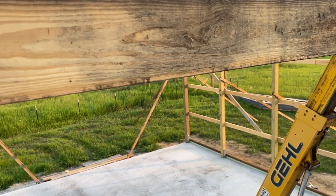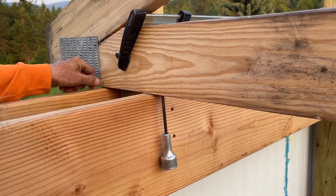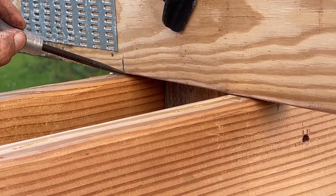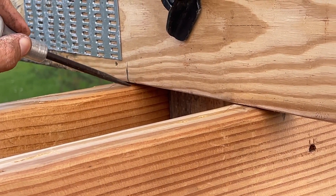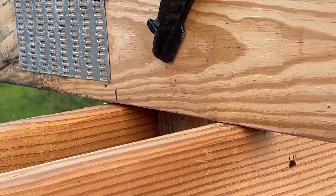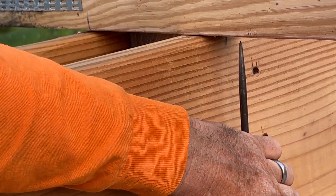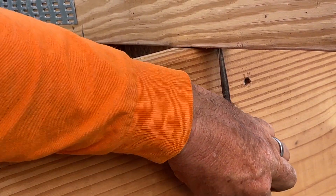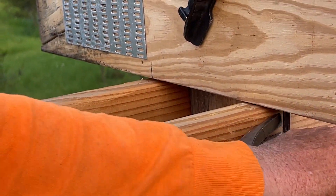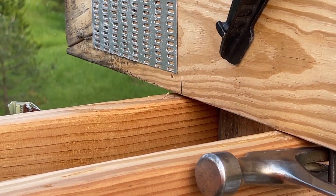We're setting trusses. That one's fine, that one's set. This one is a little bit too long — I have my mark and it's extended about half an inch. That line has to be on this side. I can't physically push it because we've got cross bracing securing it, so — old-fashioned awl trick. Pull again. And there we are.